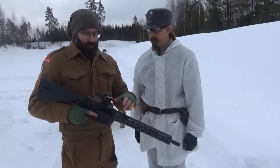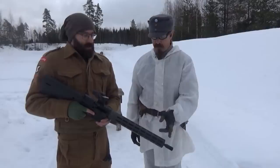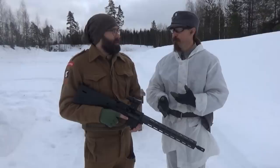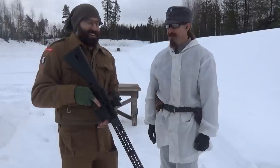The bolt group uses a Stoner-type direct impingement gas system, mid-length, which is the way forward if you have a less-than-20-inch barrel. Standard barrel length on this is 16 inches. We have every intention of running these in Europe — I know some countries prefer a 12.5 or 14.5 inch barrel, and some countries' legal situations mandate something more like 18 inches.